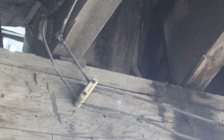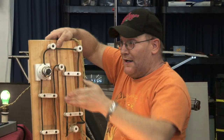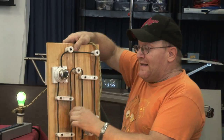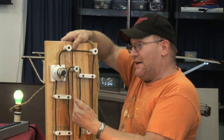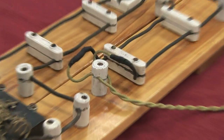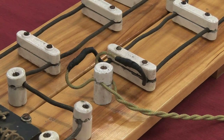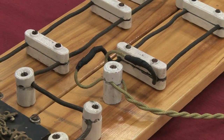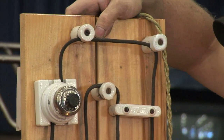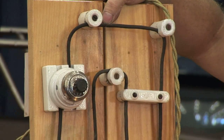But when the wires run in between the floor joists or ceiling joists, up inside of a ceiling or in a wall on the studs, you can't see the wiring — it's hidden. So you don't want to take a chance of getting them too close, because if a mouse gets in the wall or whatever and they get pushed against the stud, it defeats the purpose of the insulators. So they made the knobs taller to raise them higher off the surface to lessen the chance that a wire would end up touching the wood.